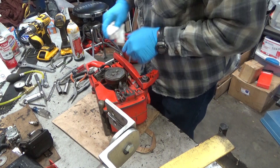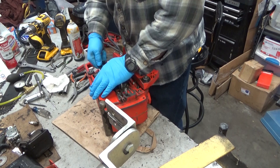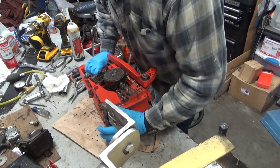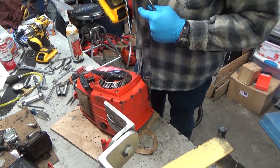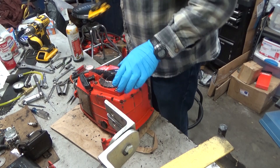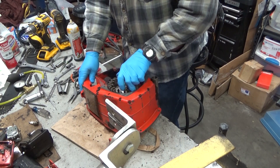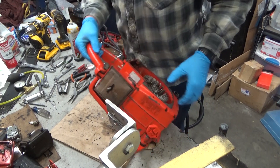I'm not going to jump to any conclusions because I really don't know. But the piston does not move when we're doing this, which I think is why Thomas was under the impression that it's got a broken connecting rod — and it very easily could. There's definitely an internal problem on this bad boy. There's definitely a lot of movement, yet we never see the piston move. We're going to find out what's down in there.